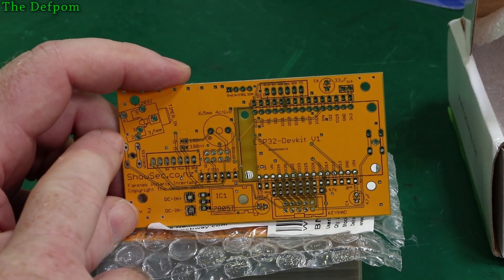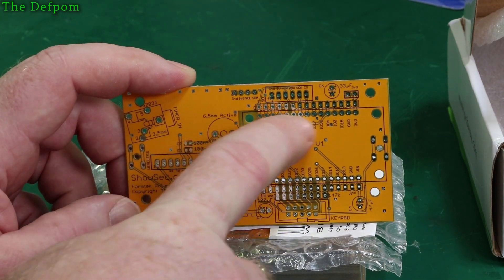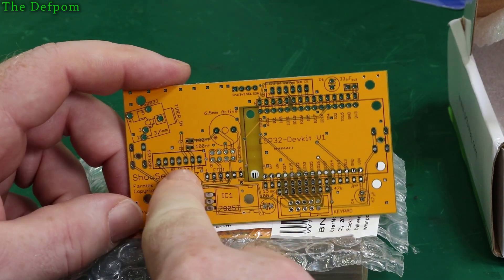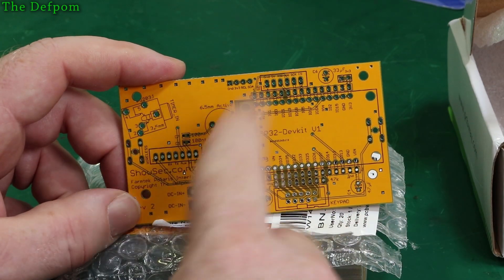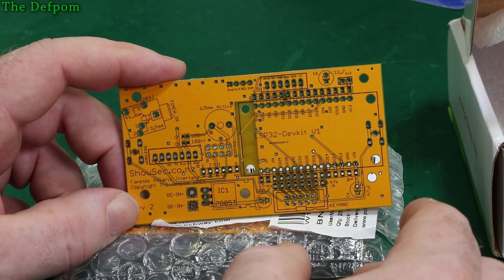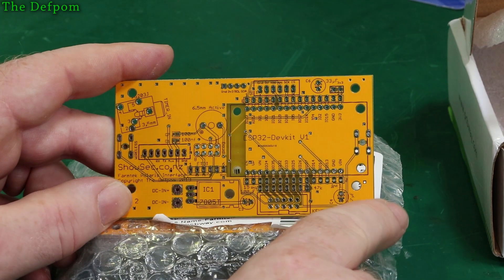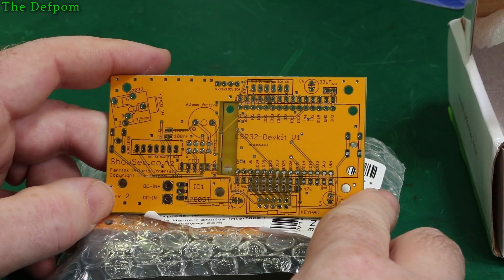I moved this connector here further over, as far as I could, and angled it so I could get a clearer path for the cable coming out. Last time the cable ran through this gap, but if I ever use this header the cable will then interfere with it — so I moved it over here. I've also changed these footprints for the different kind of connectors I'm using. Instead of using right-angled or straight headers, I'm using connectors and I've allowed for that on the footprints. I also swapped over a couple of signal lines because I had an input and an output swapped — it doesn't work as an output because it's input only on that pin, so I couldn't just swap it; I had to do bodge wires to fix it.